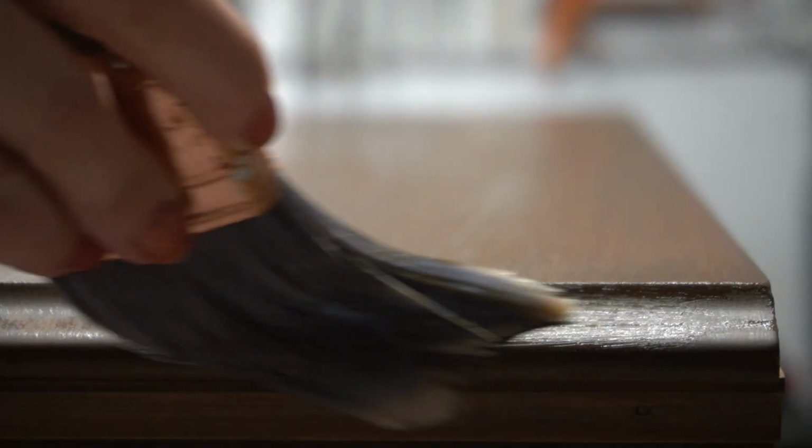In the morning, I started on the first of 3 coats of satin top coat. I'm using Fauxfinisher Varnish Plus and a 2-inch Purdy to apply it. This is my favorite satin top coat. It self-levels real nice and creates a super strong finish once it's fully cured. I applied each coat over 3 different days, leaving about a full day for dry time in between each coat.